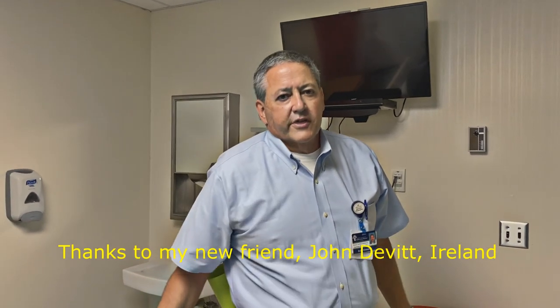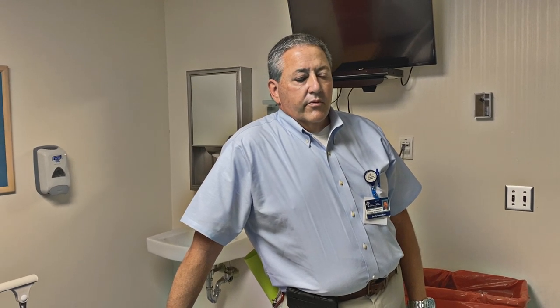I'm Scott Crenshaw, I'm the director of facilities here at Children's. He said that idea is perfect, it will actually work, but we still have to see if your rooms are capable of doing that. So Scott, what exactly did you do? Basically we've cut off the supply to the room — we have no supply coming in, strictly just all return. The negative side is that this air does return back to the house system, but it is filtered at the air handler. We just have to see how we can control the temperature by leaving the door open so the room will stay cool until you put a patient in it.